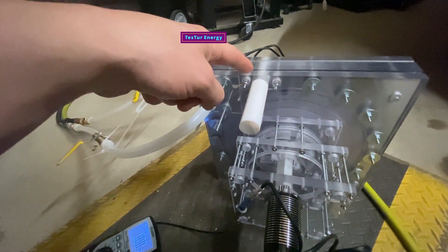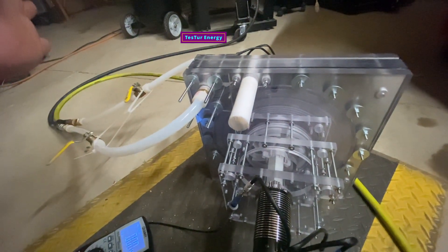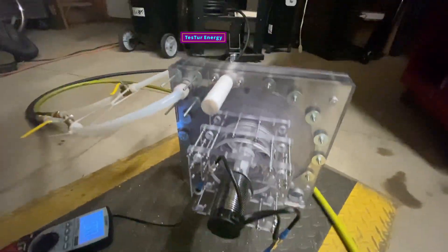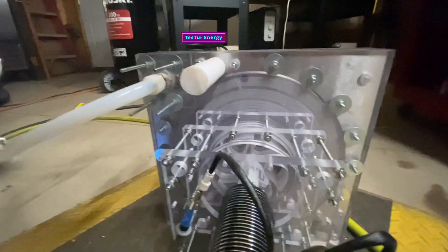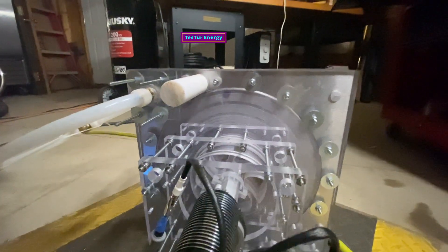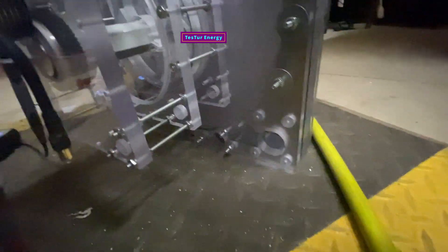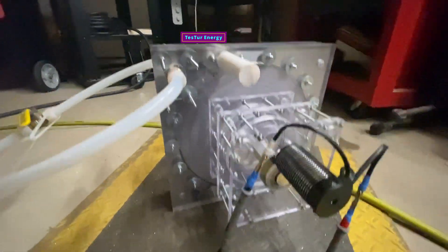I'm not going to touch the variable nozzle because it is very touchy — you can go very fast but you're not getting enough flow; the hole is just too big for the air supply. That said, this means I'm also prepared to use it for much much larger airflows for when we do the cryophorous turbines that require much larger flow areas for the very low density, vacuum-pressure steam.